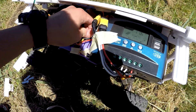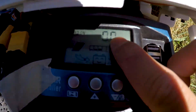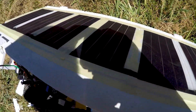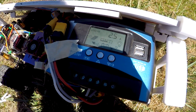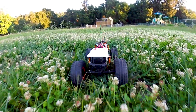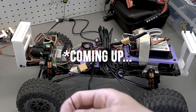If we look at the output current of these cells on the MPPT, it literally says zero amps because the current is so small it's in the hundredths place and not being displayed. When this car is running, the setup draws about 2.5 amps. So theoretically, if I could find a solar configuration that could output the same or more current, then this rover would achieve self-sustainability. While I originally chose these cells for their durability, I plan to change them to conventional monocrystalline cells for maximum efficiency. I think there is something very promising in this rover, and my plan is to make it run forever so it can do autonomous missions someday.